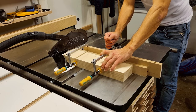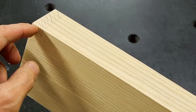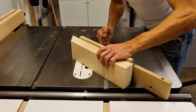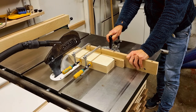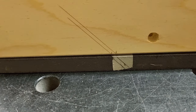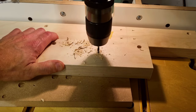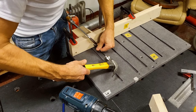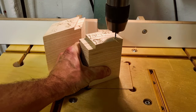I cut one end at 45 degrees and the other at 90 degrees, then lay out what I call the landing grooves. These grooves are cut using the miter gauge. With the grooves cut, I cross-cut my blade guards to length. I use the saw blade positions to lay out the positions for the blade guards, then drill a countersink from the inside of the fences for the blade guard screws. I use the center punchers to transfer the holes from the fence to the blade guards and pre-drill for the screws.